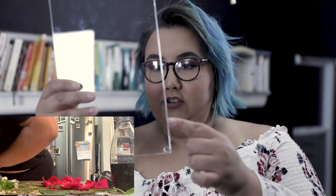I did come up with some hiccups while working — this is actually a messed-up piece. I have a Glowforge hack for you: you can see the edges are kind of jagged. That's because this is such thick material. With regular acrylic, cut at 130, full power, and it'll probably have no problems. But the thick acrylic is closer to 115 power, and I found that doesn't actually cut all the way through.